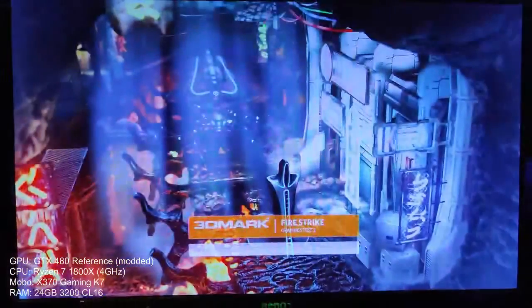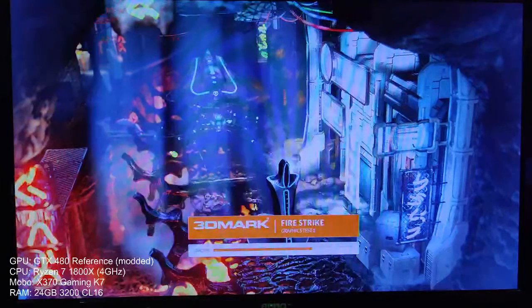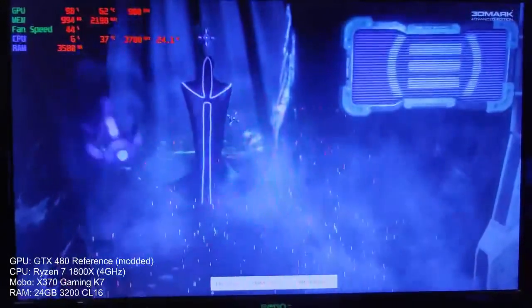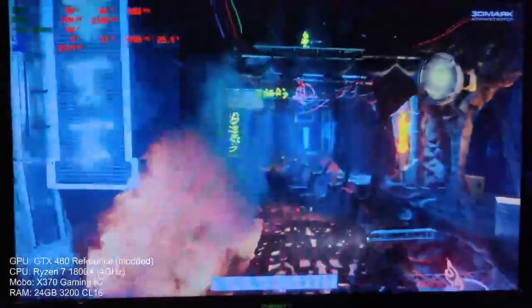Yeah, so it looks like... well, let's wait for GT2. If this passes. Okay, 2P, yeah. I'm going to run the 580 after this. The nice thing about the Lightning is MSI Afterburner allows you to adjust memory voltage without a volt mod. And even PEX voltage, though that's not of any use for me, because that's for liquid nitrogen. If you have cold bugs, then you touch PEX voltage. If you don't, then you just don't touch PEX voltage. Yeah, but this seems to pass.